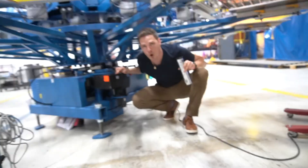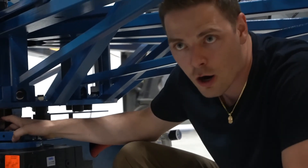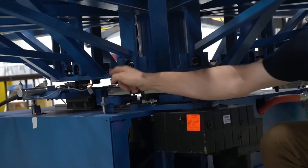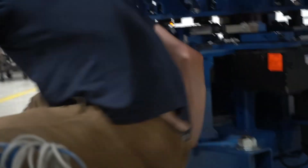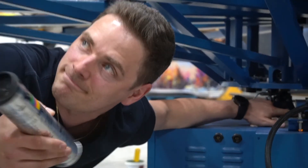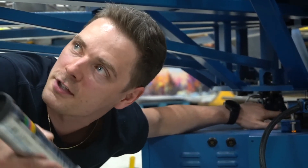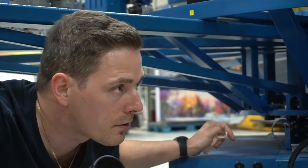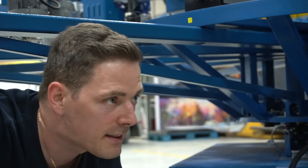Now on the other side of the machine, we have two more grease fittings for the crank arm assembly for the indexer. And then the last one is right here — this grease fitting that probably 80 to 90 percent of customers don't even know about. So that gives us 15 grease fittings total. How long does it take to do all of them? Probably 5 to 10 minutes. That's it.